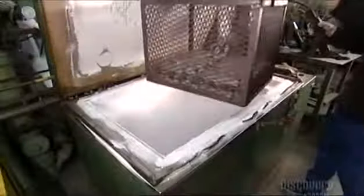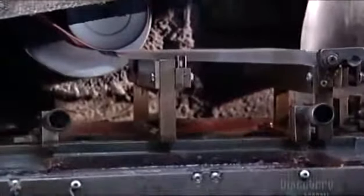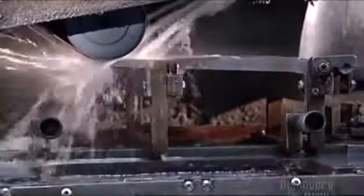Out of the fire and into the freezer. The blades chill out at sub-zero temperatures — minus 49 degrees Celsius — for two hours. This freezer is cooled by liquid nitrogen. Now we have what they call cold, hard steel. Then they douse each blade with water while a belt grinder smooths the back of the blade and sparks fly. Continuous water keeps the steel cool and hard.